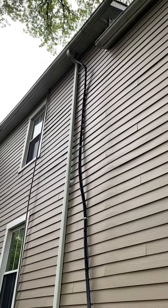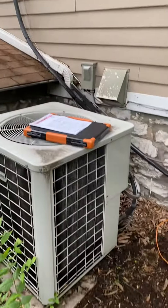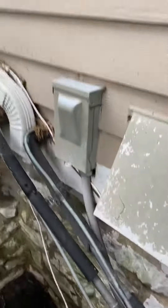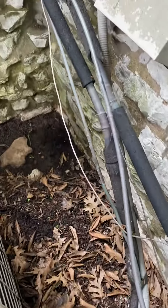The line set is on R22 — we're going to have to flush that out and pressure test the lines. Then if everything's good, we'll swap it over to R410A. The disconnect is all going to have to get replaced, re-run new lines, and then re-wrap all this right here — it's all coming apart.